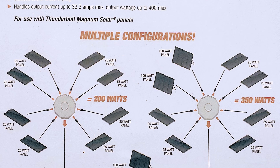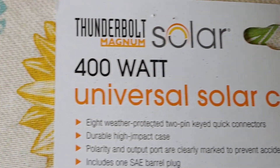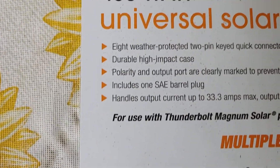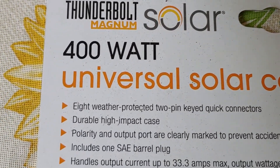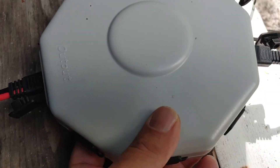This is just the sheet on it. If someone would like to pause and see what's here to see if this is of any interest to you, feel free to pick one up if you want to connect a lot of different solar panels together. Just remember, don't go over 400 watts, and make sure whatever charge controller you're using can handle at least 500 watts, just to be on the safe side.